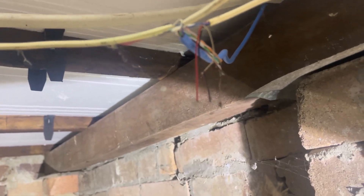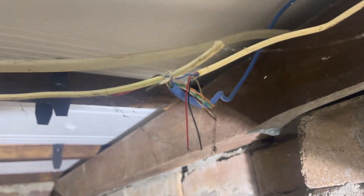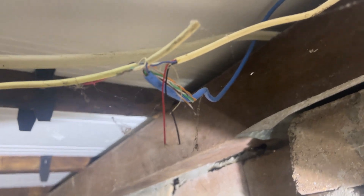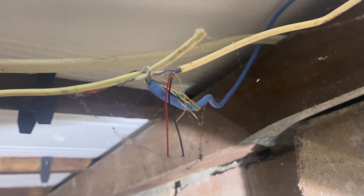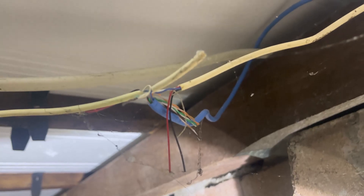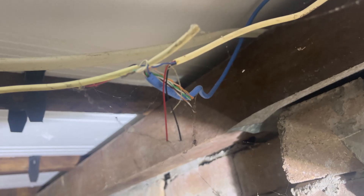So there's bridge tap number one. You can see that the Sparky or old-school telecom techs — where they used to cut the insulation off, twist the cables together, and then pop that bit of yellow insulation over. So I'll need to remove all these bridge taps here. There's a few under here.